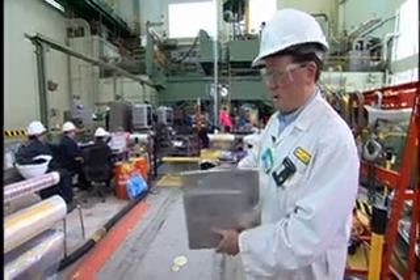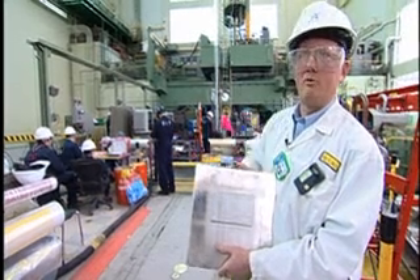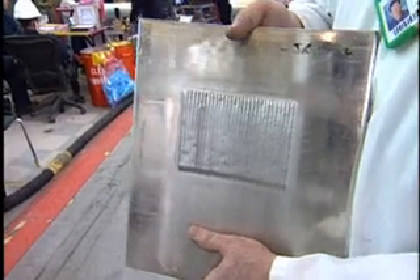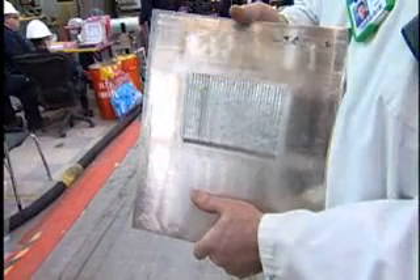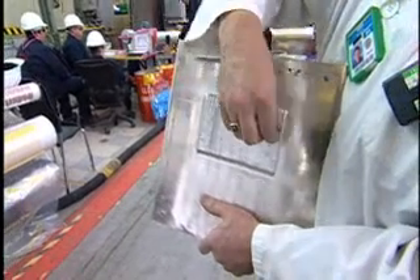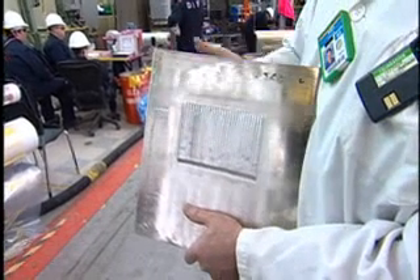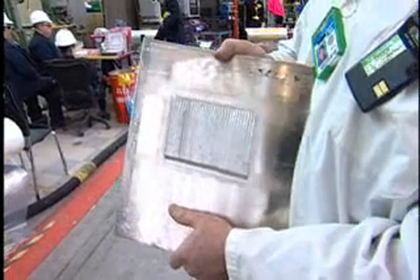The vessel is circular, about 12 feet in diameter, so all of the surfaces that need to be repaired are indeed curved. There's a lot of precision required to make the weld torch travel along the necessary path on the surface of the vessel in order to produce a good weld. One of the big advantages of the horizontal welding tool we're using is it has already built in the capability to follow the curvature of the vessel as we apply horizontal welds, and that's one of the reasons we're going to that tool for the second phase of the repairs.